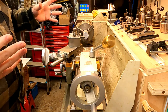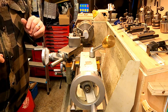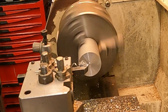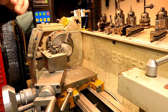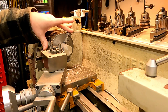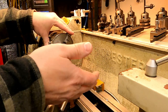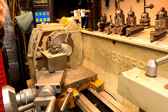First of all, we're going to clean all the faces up so that we've got nice clean faces to take measurements on. So we've cleaned up the front face, and now we'll clean up the side face here. With a three-jaw chuck they are self-centering but generally not very accurate, so you always clean up both your faces where you can — at least they're parallel to the machine, which is where the majority of your accuracy comes from. We'll take some measurements and then we've got to make a spigot that is 19 millimeters in diameter.